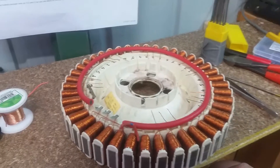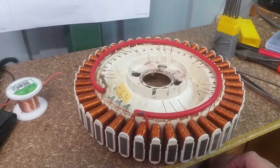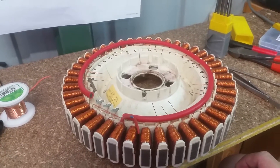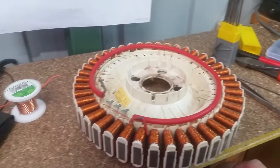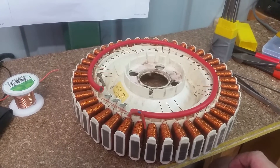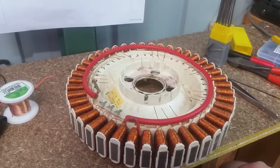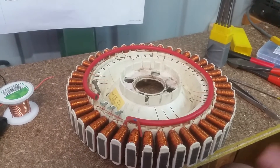Then we'll have to get an inverter to change that back to 240V. We're guessing this will put out at least 750W to one kilowatt — we might get more but that's about all we'll get if we're lucky. That's a good start considering the actual devices are only worth around 30 dollars. If you can get a secondhand Fisher & Paykel washing machine you might be able to grab the motor from underneath. There are two ways of using this: wind turbine or water — I don't have the water here so we're going for wind turbine.